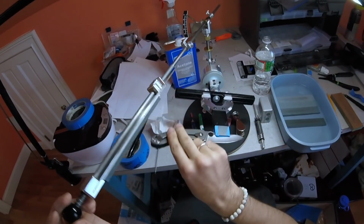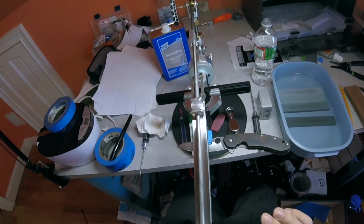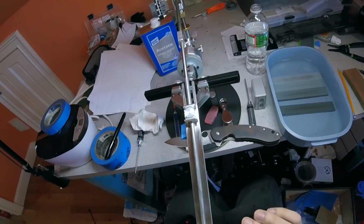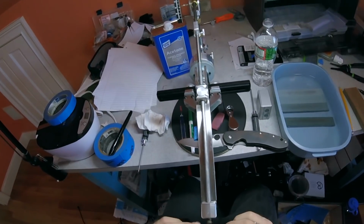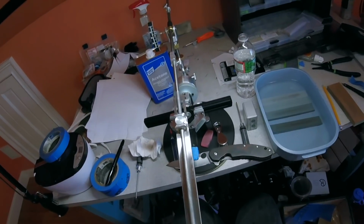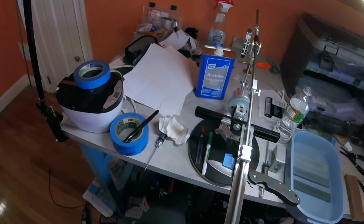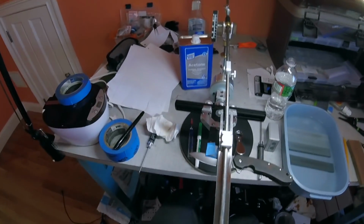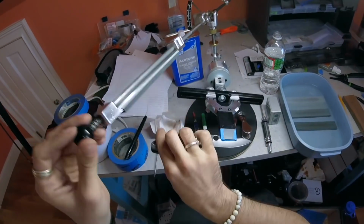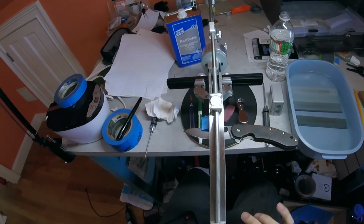Okay, so I flip sides, get a burr, whatever, go back. So the burr is there. Once you can feel a burr, I would recommend never doing more than about 10 to 20 strokes in any given area before you flip. And every once in a while, if you've been doing that a while, I'd recommend just doing a couple burr reduction strokes. So what that looks like, right?